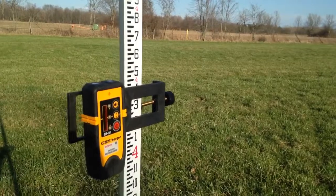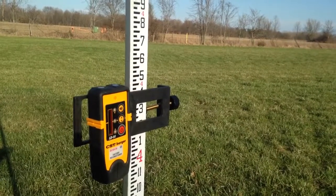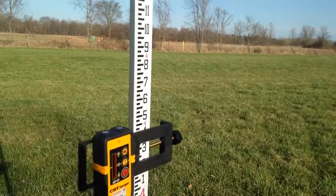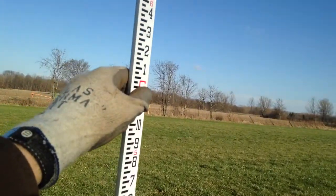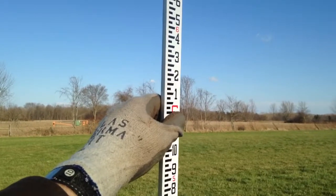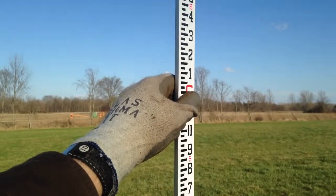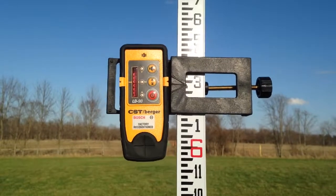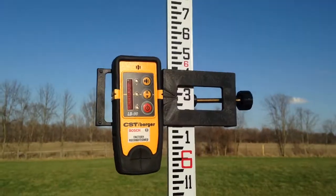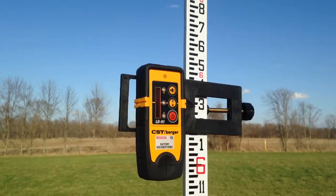It's worth pointing out that when we're trying to find one foot elevation lower than a contour, we want to set the laser level up a foot — at six feet two and three quarter inches — to compensate for the foot in elevation loss we're setting the contour line on. After making that quick adjustment to six feet two and a little over three quarter inches, we've got things set up and we'll start finding contour lines, listening to the song of the laser bird as we find contour.